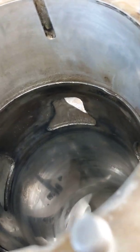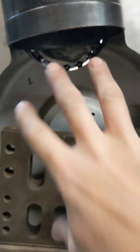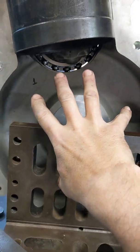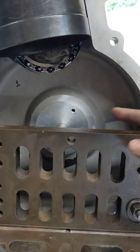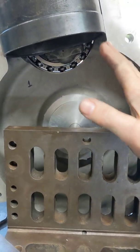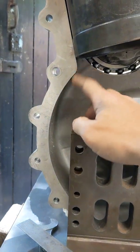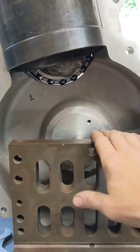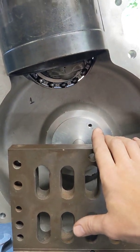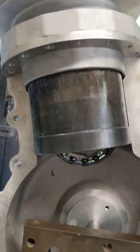Hopefully that's a whistle-stop tour of how the valves work. I'll do a better video when everything is able to rotate freely and the piston is in as well — you'll have a better idea then. The next job, once I've got that sleeve clear, is to fit the whole con rod and big end assembly in here and check that at the extremities the con rod clears this part of the case here and this part of the case here. If it doesn't, there might be a bit of machining required on both sides of the crankcase. So that's what we're doing — thanks for watching, more updates to follow.